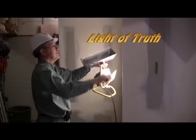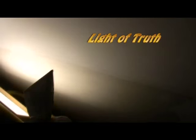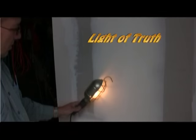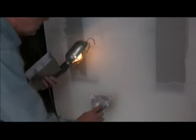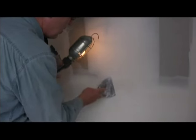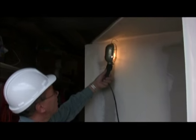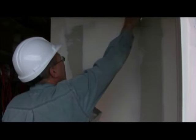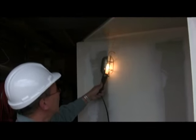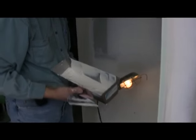Step 7: the light of truth. Knock off any surface imperfections. Dust or vacuum the surface, then get a lamp or trouble light — the light of truth — and shine it at a low angle. You will see any imperfections, perhaps more than you care to see. Fill in any drag marks, air pockets, or other imperfections with a small amount of thinned mud applied and drawn down tightly with either knife. I like to use the 4-inch knife since I can exert more pressure and leave as little mud on the wall as possible. If you are seeing faint washboard-like waves even after knocking down the surface, you can remedy this by applying a very thin coat of mud drawn perpendicular to the waves. This is much better than trying to sand the surface level. When dry, knock down the surface again.